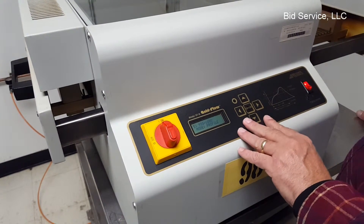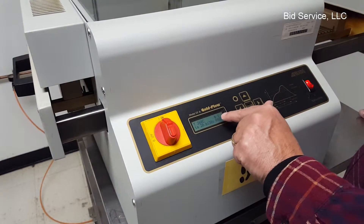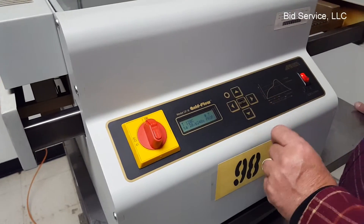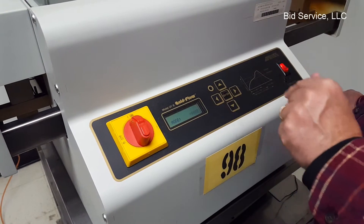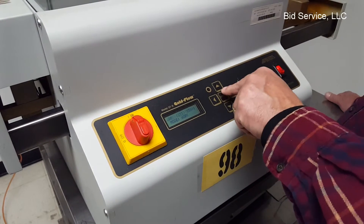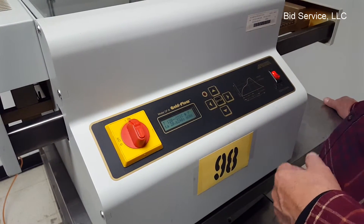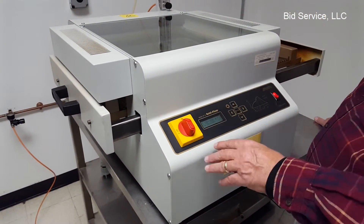Profile and work are the ones you're probably going to be dealing with most. If I hit enter at profile, I can see it's flashing number one, and by using the up and down keys I can scroll through different profiles that have been entered. When you pick one — say okay I'll take this one — you just hit enter, it goes back to the main screen, hit the down arrow key to work, hit the enter key again, and at this point it'll get ready to start that profile. Then your cycle resumes however you want to do it, and you can set in whatever profiles that you want.